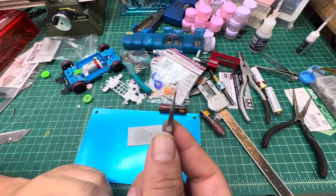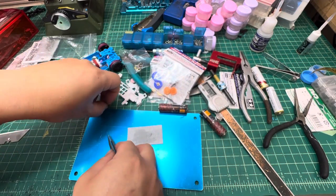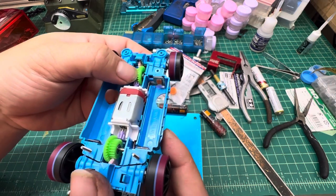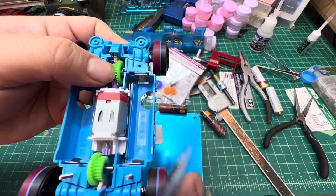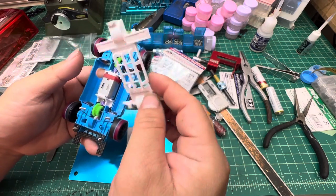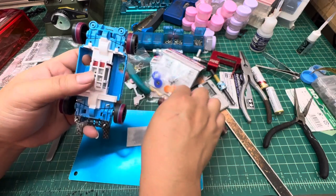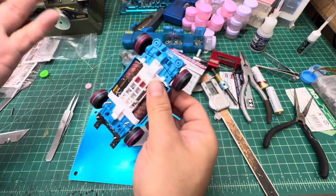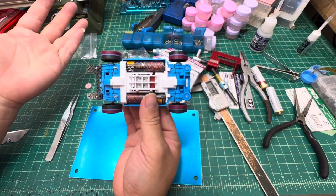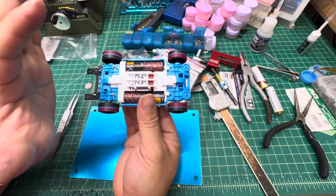Let me show you — it's already been sanded a little bit. Let me put it back on. Now you can see the gap is getting smaller, which is a good sign. If it still makes noise, just keep making it slightly smaller. I didn't put any grease on the gear so it might sound a little odd, but you can tell it's smooth — no force-grinding sound, no weird sound at all.